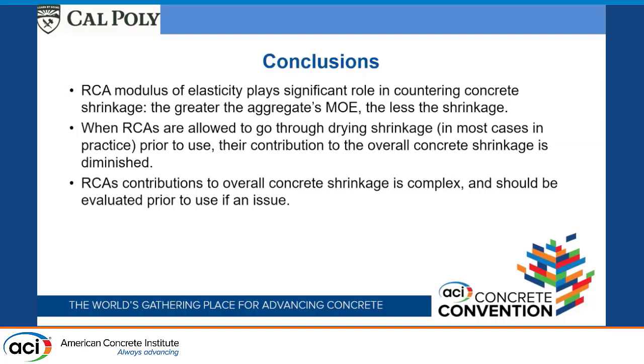I want to be clear that I don't think that having it dried out is creating such a dramatic influence on the modulus of elasticity. I really don't feel comfortable making that a conclusion, because that would have dramatic consequences in the design process. Yes, because we would now have to specify a minimum Young's modulus, which would then have consequences in the production process. Okay, so that doesn't hold. No, please don't take that as a conclusion. Okay. Thanks very much.